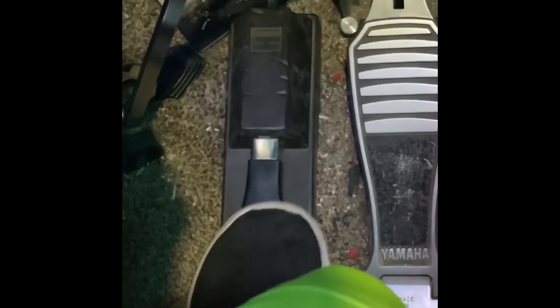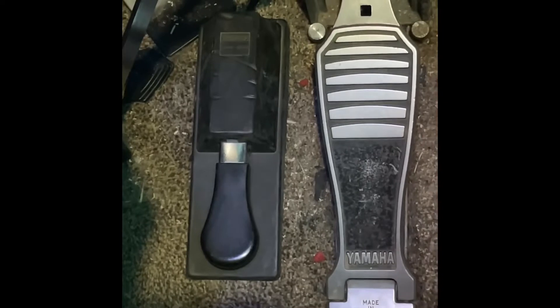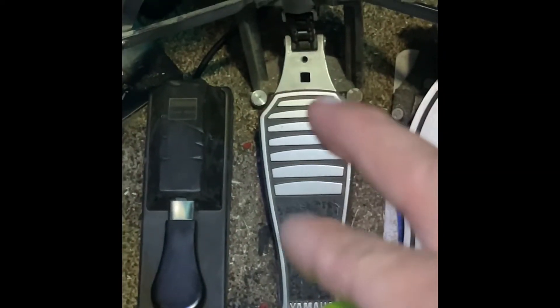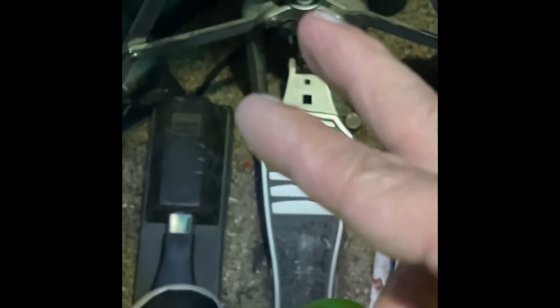The piano doesn't work, but the pedal does. The only thing is the switch on that pedal is normally open. When you push on the pedal, contacts close, but no sound happens until you release and it opens again. So I've got it right now wired into a foot switch on this SPD-6.